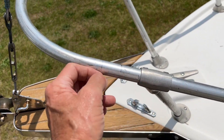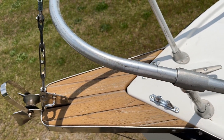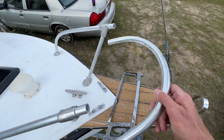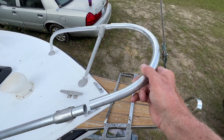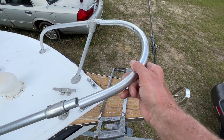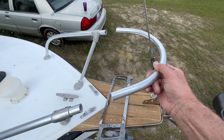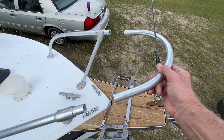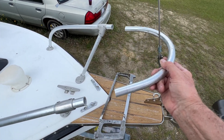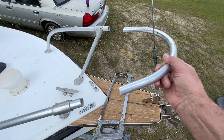You just slide a tube over that and over that and epoxy it in and maybe put a rivet in. You can see it had a little bit of outward tension on it. When I cut it, it sprang apart just a little bit, but that's actually not a bad thing because when I extend it, it's going to need to be a little wider. I'll just put a sleeve in there to extend it to get it out past the forestay, and then that should work.